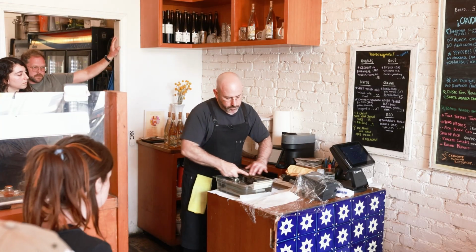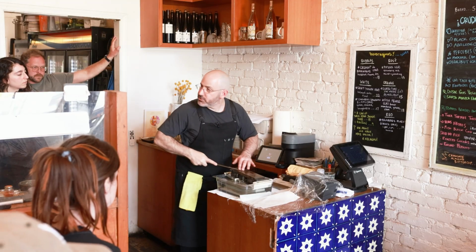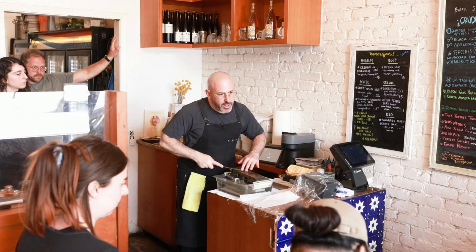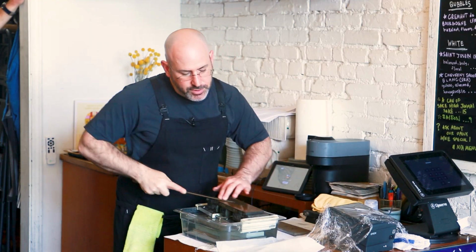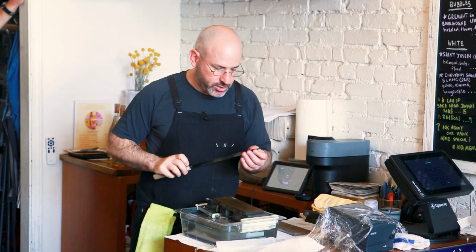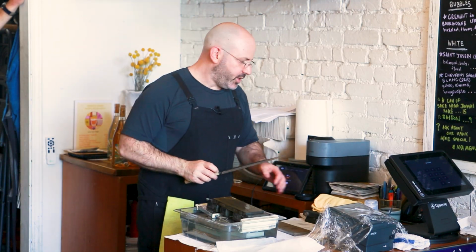So now I sharpen here at the edge. And as I do this, same thing at the tip, lifting up and rotating back towards the spine. Here, I can rely on the burr formation to make sure that I'm actually sharpening the edge. So feel for it, have a burr that's even and consistent from heel to tip, and that is that.